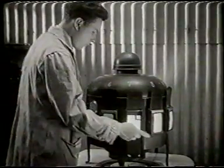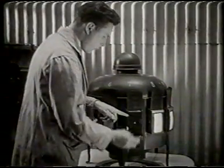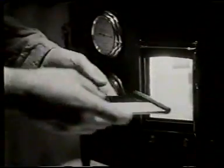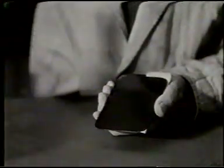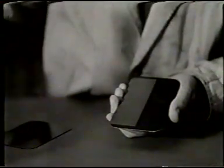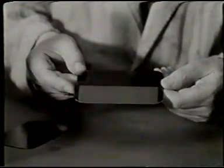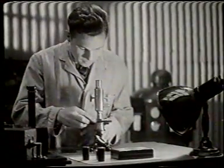Weathering ability is tested by ultraviolet light, a test of 1 day in this apparatus being equivalent to a year of normal use. Half of each specimen is masked, so that the effect of light on the unmasked part can be compared with the protected half. A paint with low resistance is quickly detected in this way. See the results under the microscope.